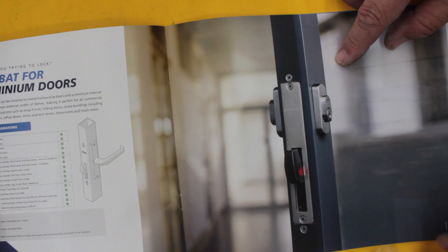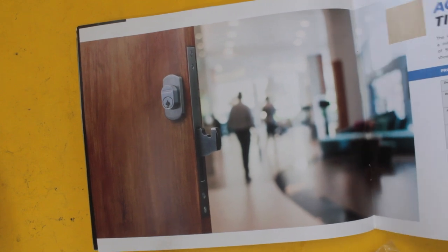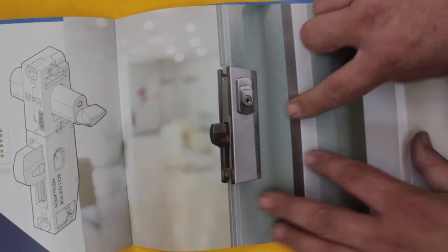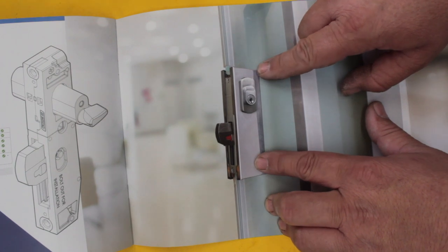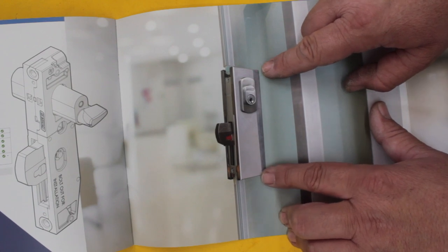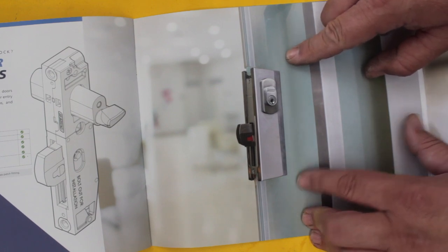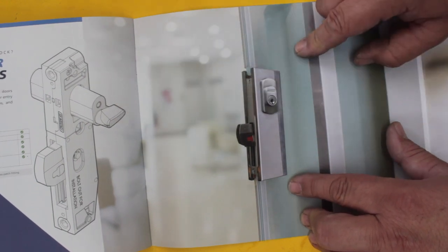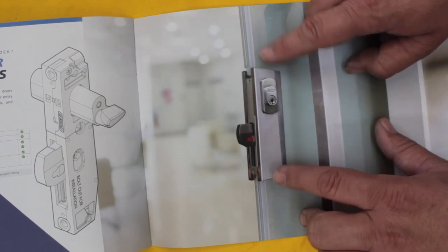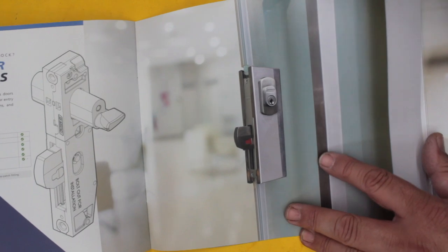It's not a bad looking lock — definitely not a bad looking lock. These interchangeable bolts are something different. There it is then with the wooden strike on the front. Now the glass door was something I found interesting: if you could put that lever handle on the inside, I'm not sure if there's enough room, but if you could do that it would be very good for egress where you need lever exit on the inside compared to having a thumb turn. On saying that, it would leave the door somewhat vulnerable to a coat hanger attack compared to a simple thumb turn snip. But it could be a possibility — I've seen some premises where it would have been nice to have a handle on a glass door set up just like this.